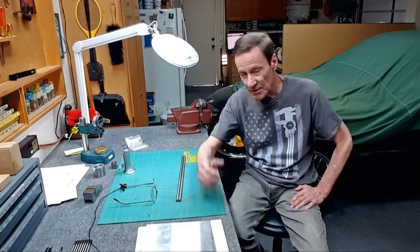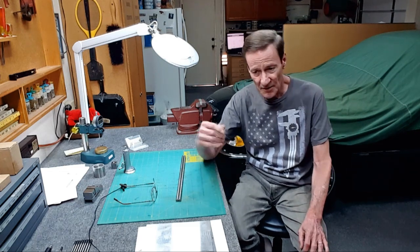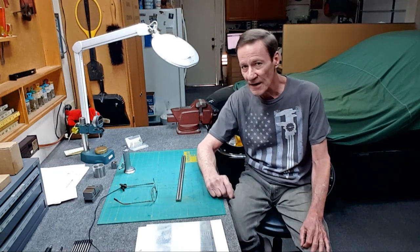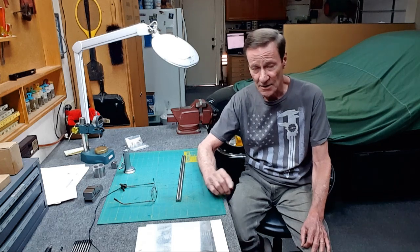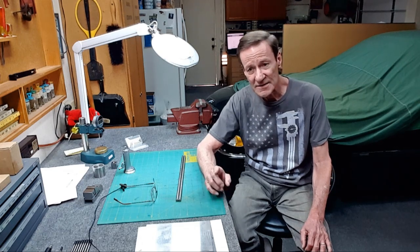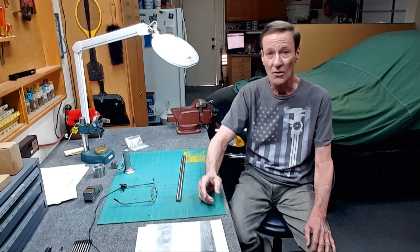Somewhere towards the end of the video I mentioned that my dream of expanding it out 500mm went in the trash can — not really. I did find on Banggood a 2-start T8 500mm lead screw, an X2 2-start, so every revolution gives you 4mm. But Banggood is also loaded with regular T8 single-start 500mm lead screws.